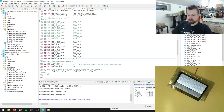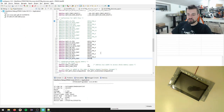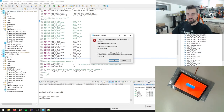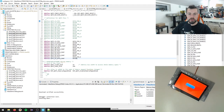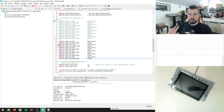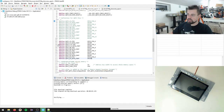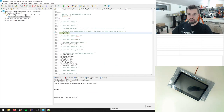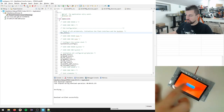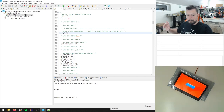Remove the old definition and try one more time. We still need the MPU part but having the right pins should definitely help. Let's press Resume. Yes! We have a working external flash. Okay, so we can laugh - this was not supposed to be like this, but we're at the 51-minute mark and now we have the external flash running.